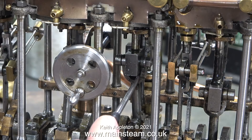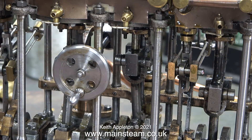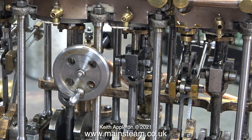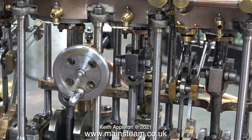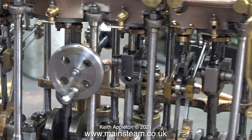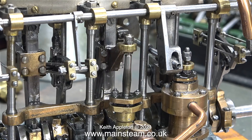In this clip I'm pointing out a few problem areas using my scriber. Initially when I look at this I think that the forked end of the connecting rod and the crossheads will probably need reaming out for a larger size of pin, but I'll only decide about that once I take the engine apart. I've slowed down this clip so you can see just how much movement there is on all of the parts. It's a good job it's a steam engine — they're the only engines I know that will run in such a bad condition.